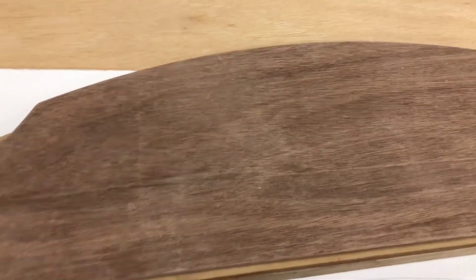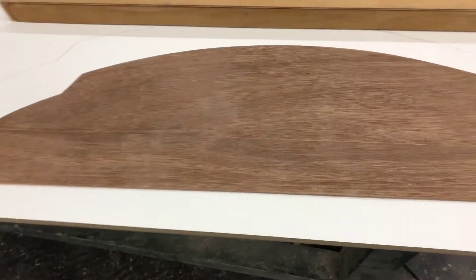So I made a new template which follows this template on the sides — but you'll see here it increases the top. If you look at it from the back, it makes it a couple inches taller in the middle and still does not impede my view out the front of the airplane, which I didn't want to do. But this new size gives me a lot more space for instrumentation.